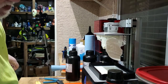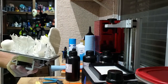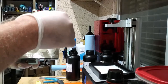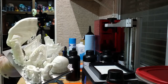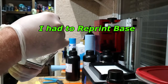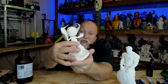With the exposure time at 5 seconds and increased density, it looks like we're good — everything pulled off the supports cleanly. The little Chibi Spawn from Dennis Moore at 3D Figure Prints also came out great. The warp did pull off the supports a little bit at the base, but it looks like it'll be fine. I had a failure but got it fixed, and Chibi Spawn came out really great.